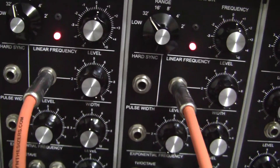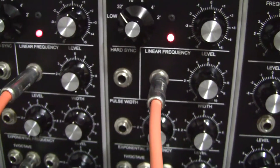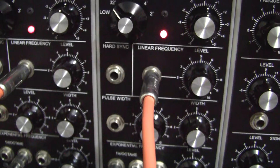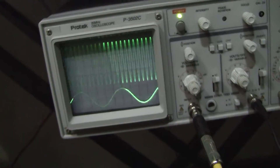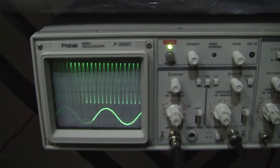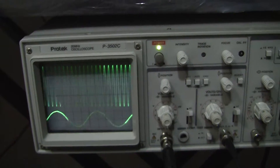The linear frequency control is basically just to establish the fixed oscillator at 100Hz, and the purpose of the linear frequency controls is to make very fine phase adjustments on the oscilloscope trace. So what you're hearing right now is the one kilohertz tone, and as you can see it's pretty stable — just sliding slightly. I'm trying to get my hand on the control now, and if I just turn it slightly, it goes stationary.